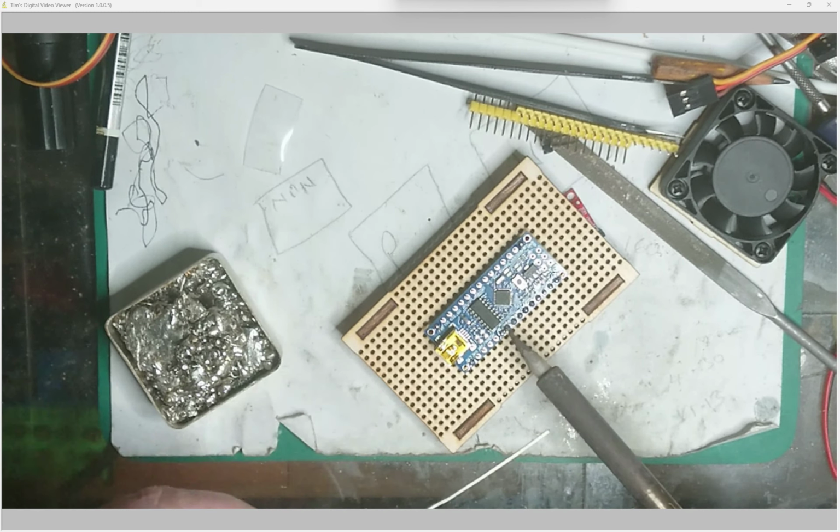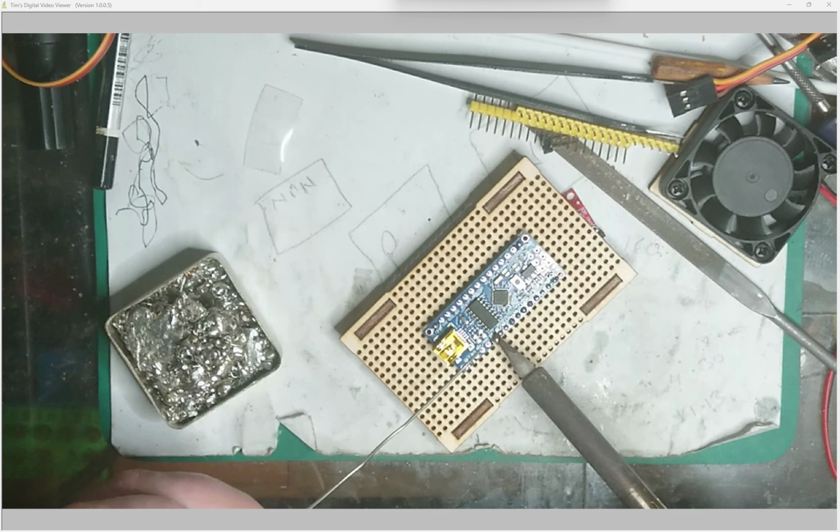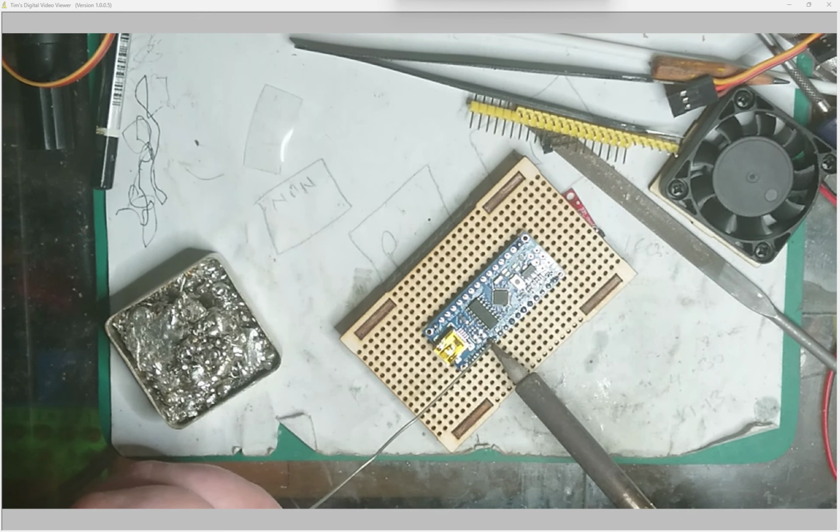Now, when I'm doing quite a long header, you need a fair bit of heat into a PCB like this, and so I tend to go down each one and get the majority of the pins soldered and fluxed. Then I'll go over it again because I like a nice, neat looking job myself. I'm a bit of a nitpicker. I like to have things looking really good. So I'll just go down this side.